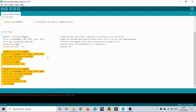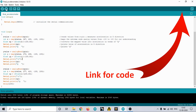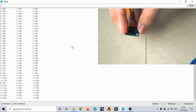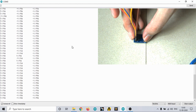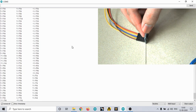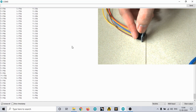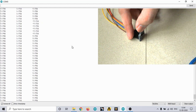After uploading the code and opening the serial monitor, I hold the accelerometer flat to the ground surface. The values we receive are 0.0g in the X direction, minus 0.02g in the Y direction, and minus 1g in the Z direction — minus 1g indicates the direction of gravity. Holding it along the Y axis gives approximately 0.03 to 0.04g in X, 1g in Y, and nearly 0g in Z.